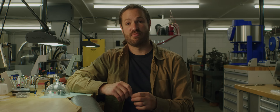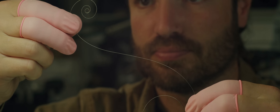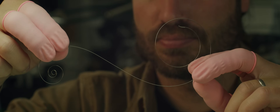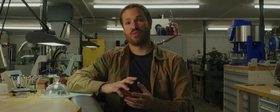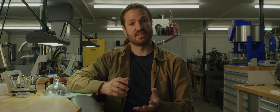The mainspring is a coiled metal spring that is made from round wire that has been flattened and then coiled. In modern watches, that coil is shaped like an S-curve so that as the mainspring unwinds, the torque remains the same.